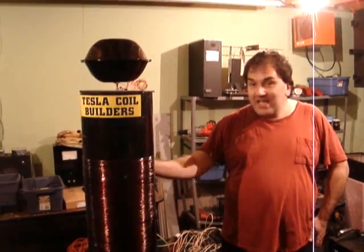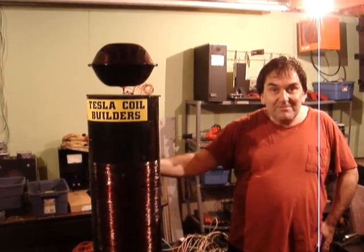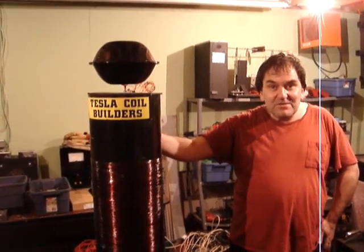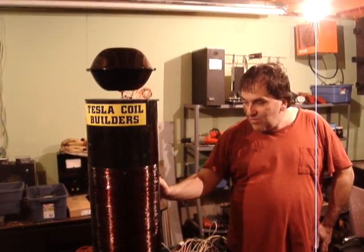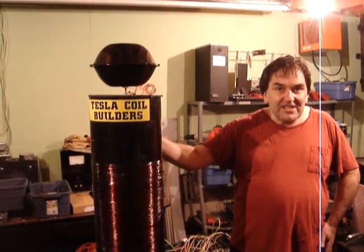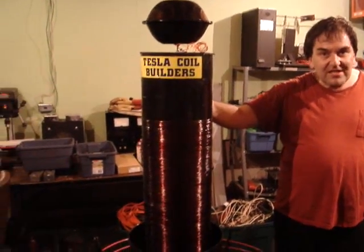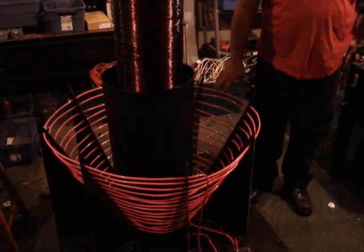Hello, my name is Robert West, and this is the Tesla coil I built. I wound this coil all up, and I used a 10-inch diameter pipe, 6 feet high, and it's all wound with 19-gauge magnetic wire — and that's the secondary on my Tesla coil.